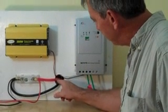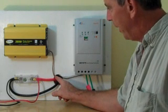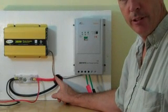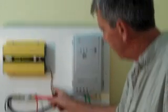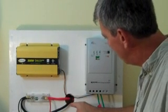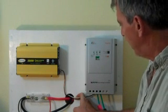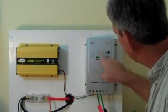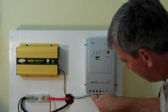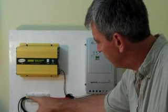These are the five wires that are coming in from outside. This is the grounding wire that goes up the pole to ground the array, attaches to the grounding rod, feeds through the box and comes through the wall — and we're going to ground it correctly to our inverter. These are the charging wires that come from our array, also down that pole, and connect to our controller — they go into where you see the array picture, right here. And these are our two battery cables, and they go to a bus right here.